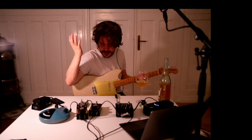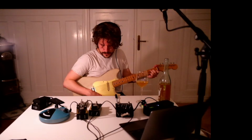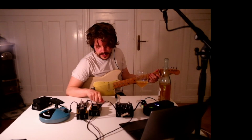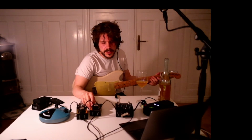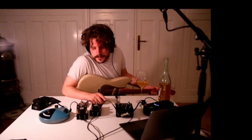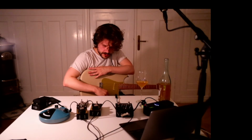As I said, you change the gain of the first phase using your guitar's volume. So it makes sense to make the gain knob do that on the pedal, so that's what it does. So the gain knob on BERSERK is doing the exact same thing as your guitar's volume knob, but it's doing it with a different type of taper and a different value for the potentiometer, which yields a quite different operation. It's not at all the same, really, if we're being honest.